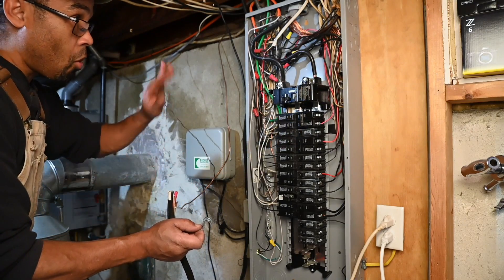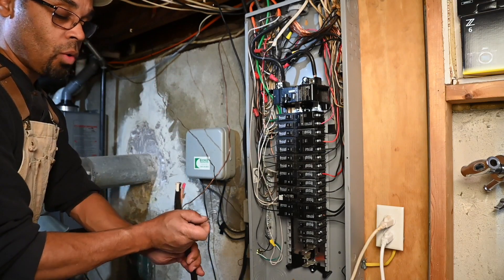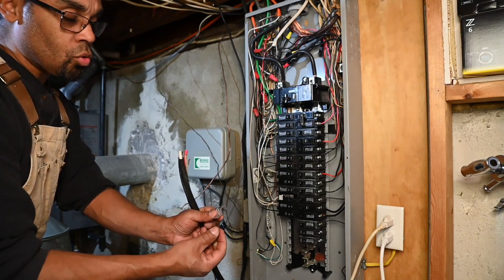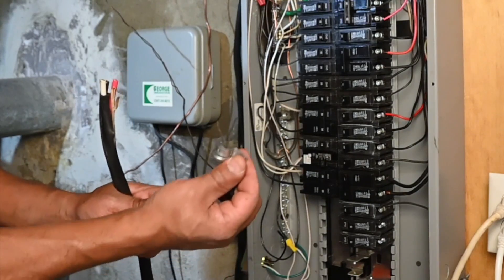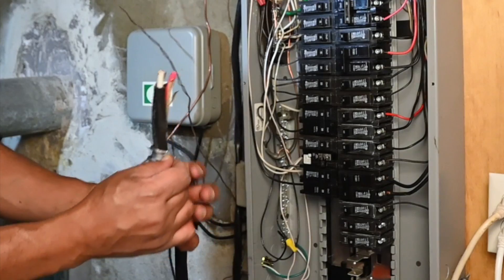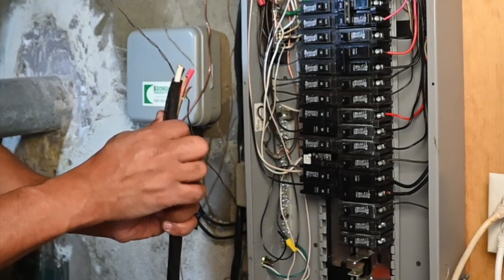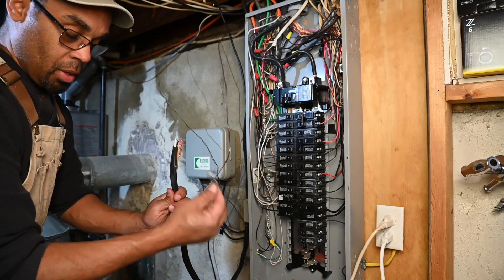It's important to lock this wire down and keep it neat, because most likely your wires are going to be coming from all over. You want to identify the wire, get it out of the way, and have a nice clean installation. All you need are some drywall screws to drill into the joist or wherever you're securing it. When you snake your wire, put this clamp on and it keeps it in place — make sure you pick up some of these.